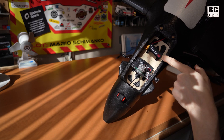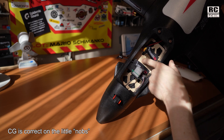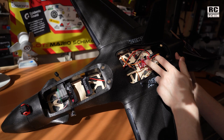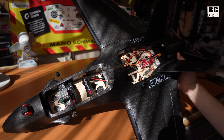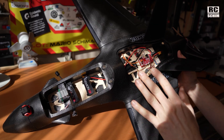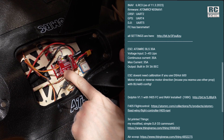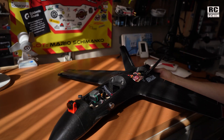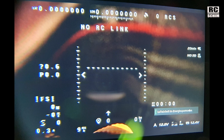The 3000 mAh Li-ion sits a bit further back and my 1500 mAh LiPos will go here. It would also work to have one 1500 pack here and the second in the tunnel. I upgraded it with iNav 6.0 release candidate 3 and it worked like a charm — it just didn't work on my Windows 11 laptop, but I used the Impulse RC driver fixer and then it worked. Settings will all be in the description. Crossfire on UART2, DJI on UART5, GPS on UART4.